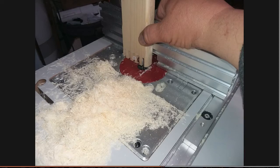And then to adjust the tongue and groove width, so to speak, I have an inside angle corner that rides in this bottom slot. That's just a little bit narrower than a 1/4 inch slot. So I wouldn't want to go smaller than a 1/4 inch.